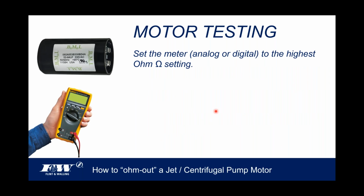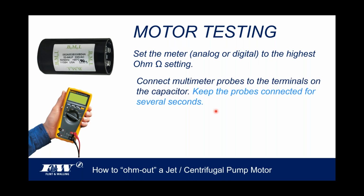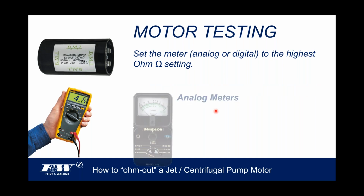So to test the capacitor, we're going to set the meter. It doesn't matter whether it's analog or digital. We're going to set it to the ohm setting. I showed you that a little earlier. I set it on the ohm setting, and then we connect our two probes to those two terminals, so connect the multimeter probes to the terminals on the capacitor. Note, keep the probes connected for several seconds, okay? And this is what we should see.